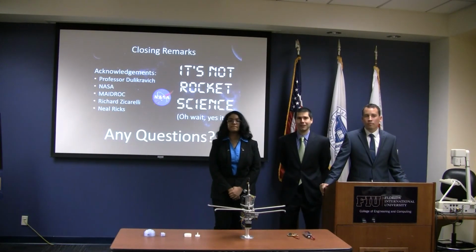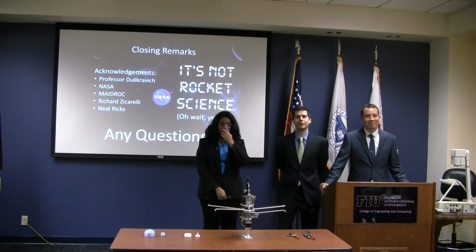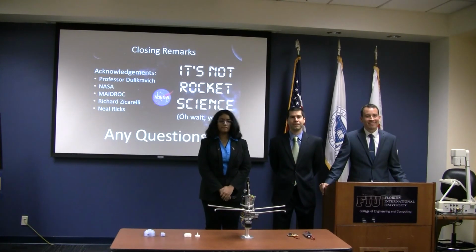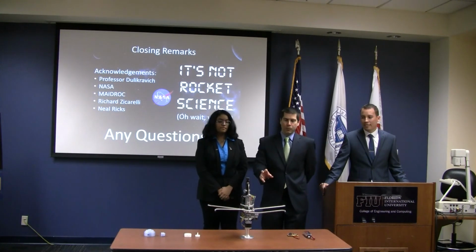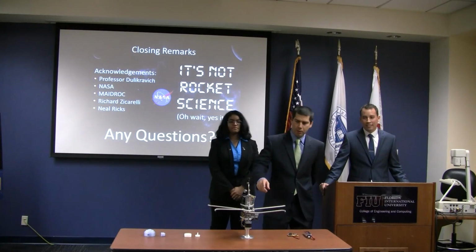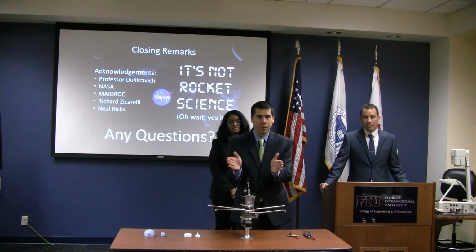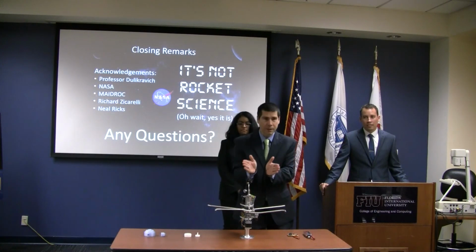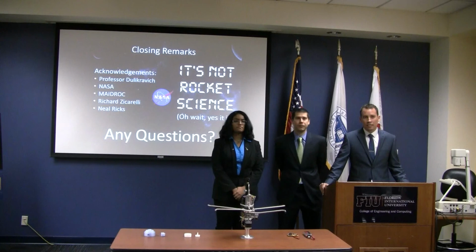Going back to that, if you need additional degrees of freedom, right now you can go forward, back, and pitch and yaw. But what if you need some other degree of freedom, up and down? Can you integrate another set? It seems to me you can, but you have to think about it. If you needed Z displacement, we could put in four more and narrow the range of the two ports of the valve inside, so it just moves a little bit instead of 90 degrees each time.